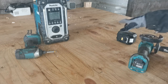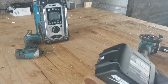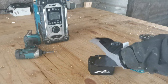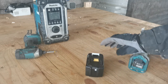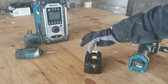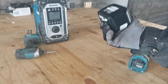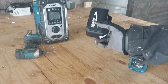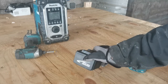So what can I tell you about? I looked at the board in depth on the Chinese battery, and there are two problems. First, I couldn't find a fuse for the short circuit protection, because if you short circuit this and this one, the battery will overheat and it will fail the batteries, and it may be hazardous as it may burn up in flames, but the chances are quite minimal